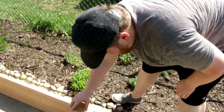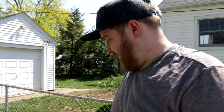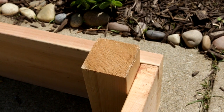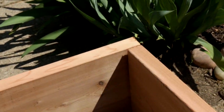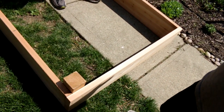And if you did everything right, it should be relatively square and very solid. We'll be doing that a few more times. We're going to use this same level surface and rotate the box as we attach more pieces. One thing to make sure you do properly is to have consistent inside-outside with your boards — when we attach that board at that end, it needs to be on the inside, not the outside. Otherwise you won't have an actual box. You can see it's consistent board placement.